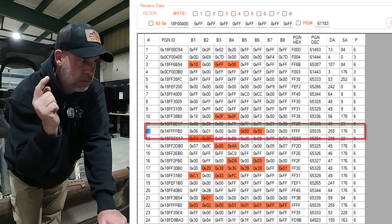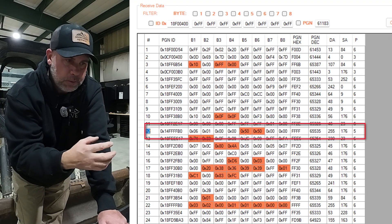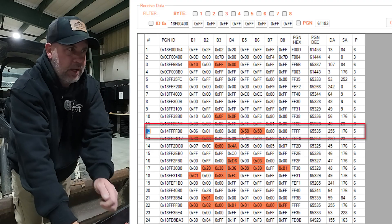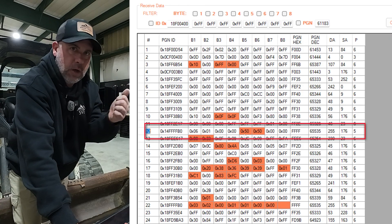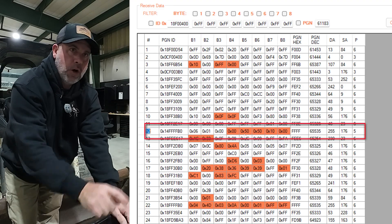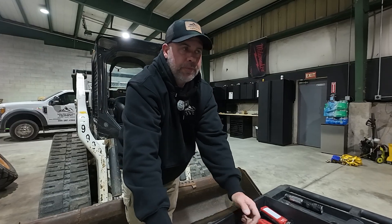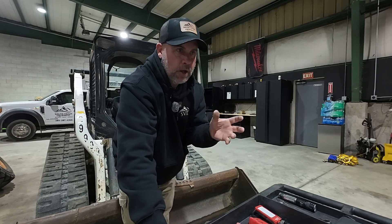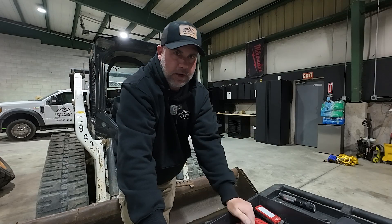The identifier has one job — it goes straight to the auxiliary control unit. We can intercept the CAN messages and confirm the information is making it all the way out to our seven-pin. So we know there's nothing wrong with the controllers inside, nothing wrong with the CAN network, nothing wrong with the seven-pin cable going to the back of the machine. In this case it was not a CAN network or controller failure — it was a power failure.